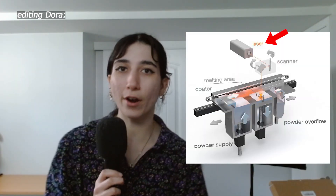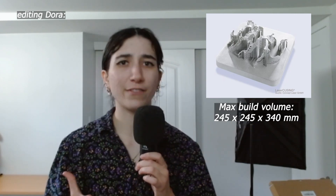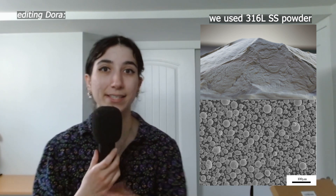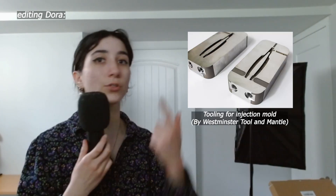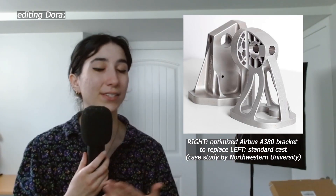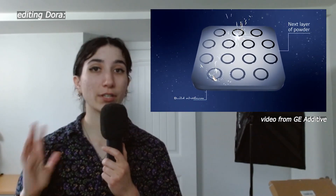The recently acquired Origin 1 by Stratasys, their first resin 3D printer, as well as a metal powder bed based system — the M2 Cusing. It was a dual laser at 400 watts. The build volume wasn't anything special; usually powder bed fusion machines don't have very large build volumes because of the nature of the process. This machine was able to 3D print in metal, and stainless steel, with a variety of applications including tooling, injection molding, robotics, hypersonics, and aerospace. We primarily did jigs, locating tools, as well as detailed manifolds.